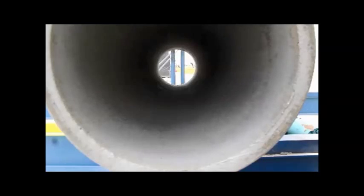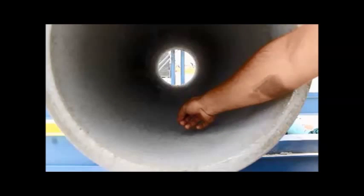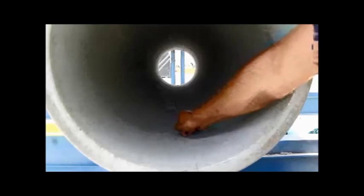19,000 pounds, 20,000 pounds. We have a little bit of a hairline crack developing here. We're looking for a 0.01 to be 12 inches consecutive, and that gauge will go in. 21,000 pounds. 23,000 pounds. We got a 0.01 inch crack here at 23.5. A 0.01 inch crack.